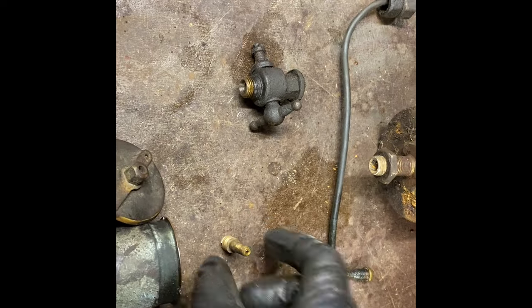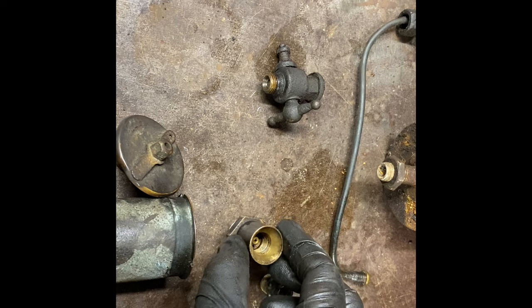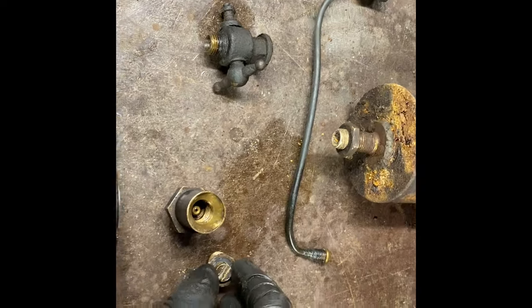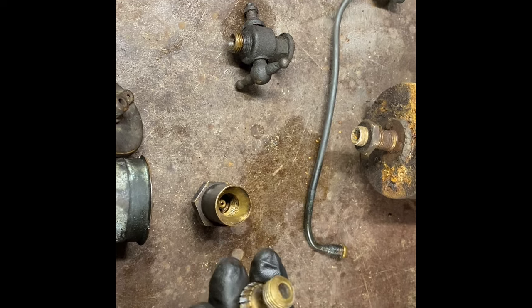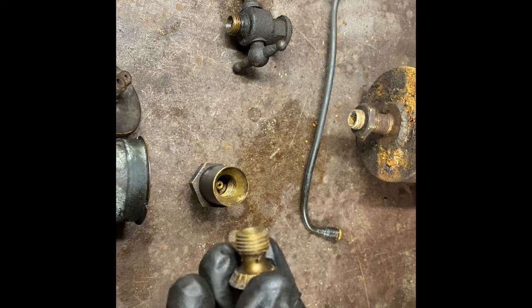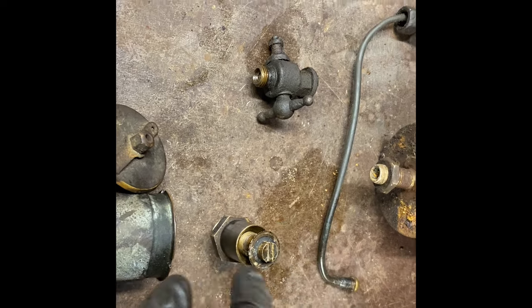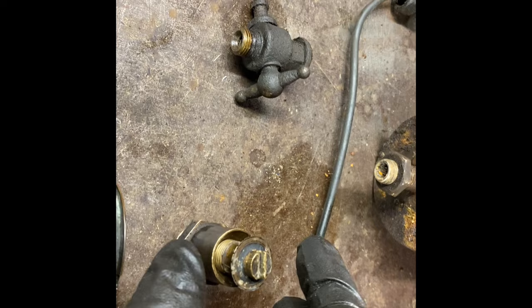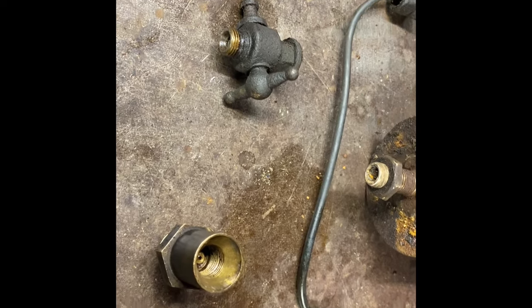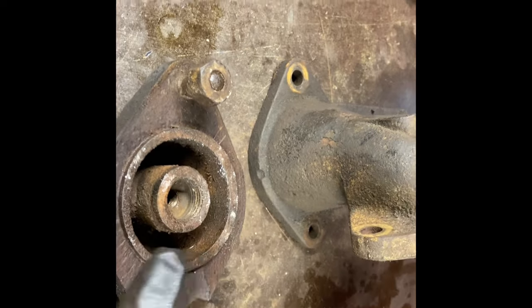So that jet is then covered by this brass fitting, which goes over like that. So the jet is then poking out the bottom. And how that works is that jet sprays fuel into the bottom of that cup, which then comes out through them holes, and out through them little grooves in that fitting. That screws in there, and the little holes make like a rose jet right around that fitting, because that's cone shaped.